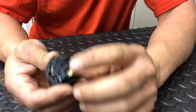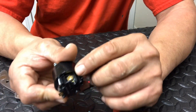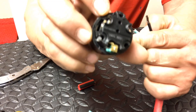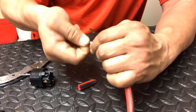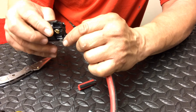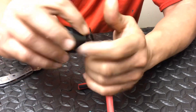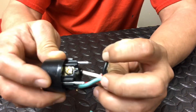On this cord, this cap has a green screw, a silver screw, and a gold screw. The green screw gets the green wire — there's a little hole for that green wire to go into. Make it nice and pretty, stick it in there, and tighten it down. Next one is the silver screw — loosen it up, slide the white one in. Then the black goes to the gold screw.